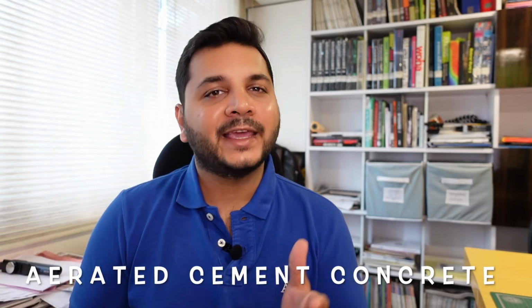In this video, I'll be talking about the things that need to be done before laying the actual flooring of your house. Once we are done laying the plumbing pipes and electrical conduits, it's time to construct the partition walls before laying the actual flooring. The partition walls can be made of bricks or of lightweight AAC concrete blocks. If you're proposing a drywall partition system using either cement sheets or gypsum boards, this step can be skipped as they are laid once the flooring is done.